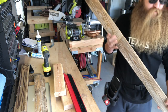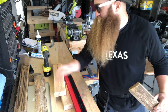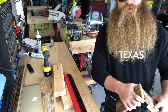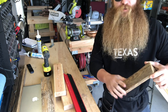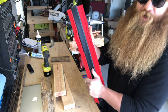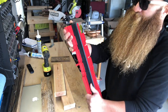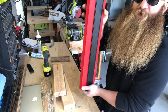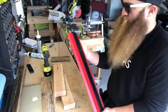On this far end, we've got to make an end piece for it. It's going to be a shorter board right-angled into the end of our valance. Now the trick cut is that we have a curved wall. I use this neat little tool that can take an impression of angles or curves up to about 20 inches wide. So I can set this against my wall, match the curve, and then trace that onto my board.